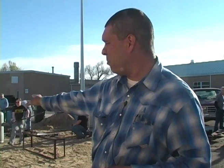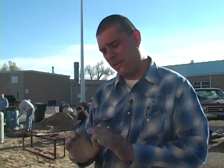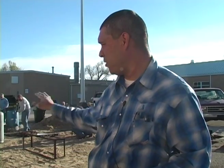There's a hole at the bottom of the tube that we push clay up into, and when it's melted enough iron, there's a hole on the other side that lets us know that there's enough iron in the well. And then this little girl over here, Stacy, will come at that furnace with a big long rod and knock the clay out, and then the iron will pour out. As long as we put iron in the top, it'll just keep coming out the bottom, and it'll melt probably 120 pounds every 8 minutes.